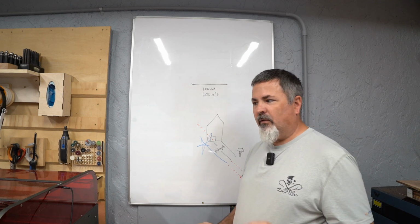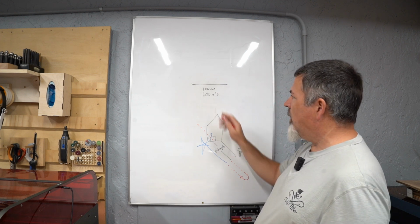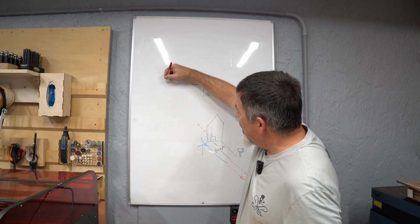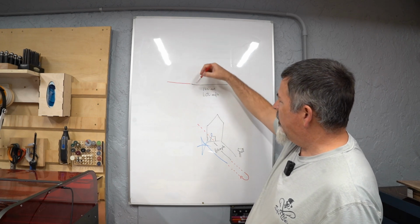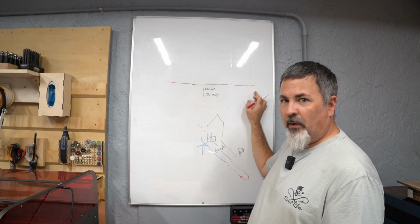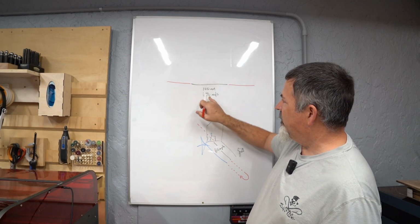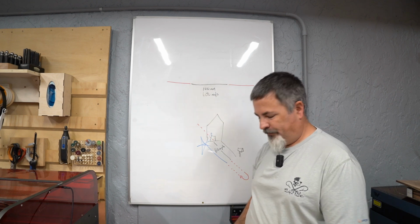A laser head needs a certain amount of time to accelerate and decelerate. So when you want your laser to go 600 millimeters per second, and that should be mm, you're going to say, I need this much runway to accelerate, get to 600 millimeters per second to do my engraving, and then I need this much runway to decelerate. Usually these are pretty close, acceleration and deceleration. I'm saying I need that much time so that in order for me to be at 600 millimeters per second at the start and the end of the burn, that's what I have to do.